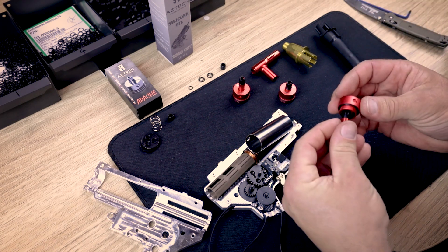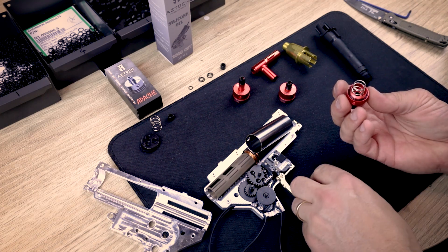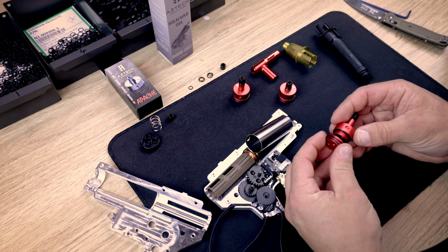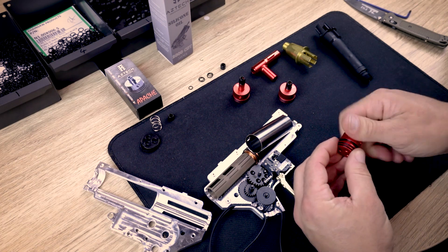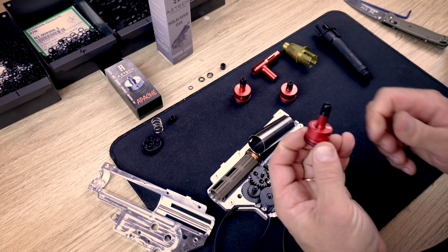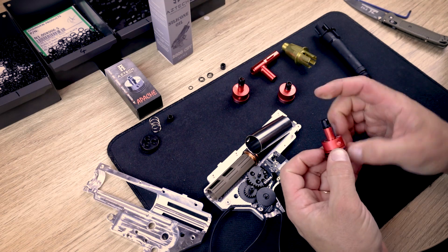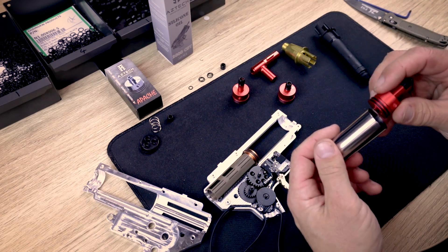To do that, put your nozzle back in your top cap, spring under it, put it upside down and screw it back together compressing the spring. Wind it down and snug it down on the o-ring so it's nice and firm, and now we have it in its most forward position. Sit that back in your cylinder.